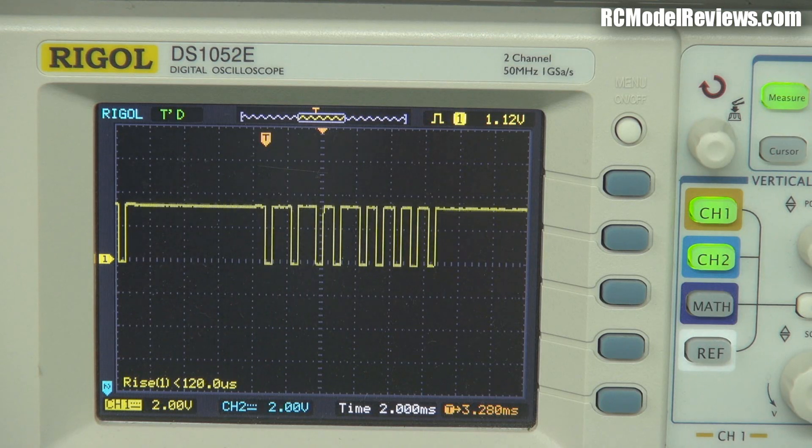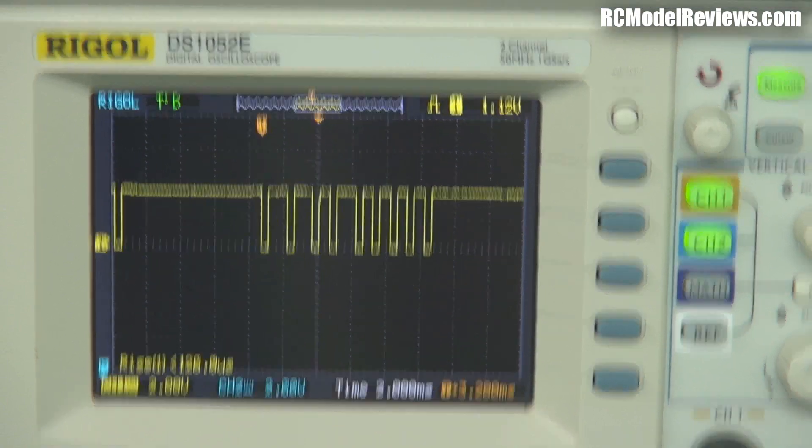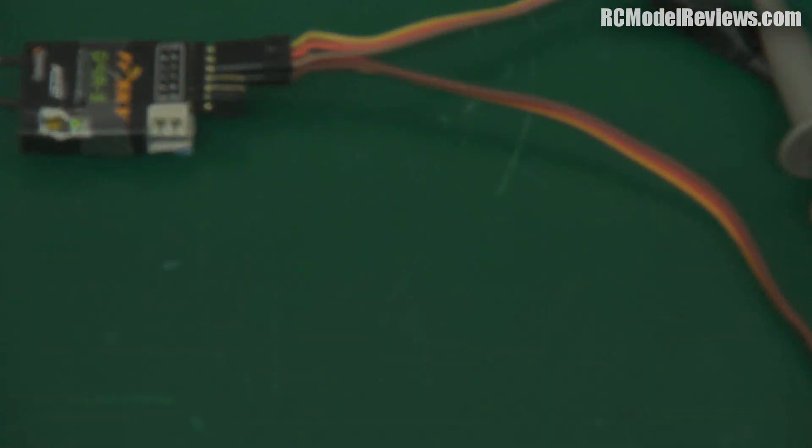If people want to see it, I'll show you how to reflash your D4R-2 and other FrSky receivers to use a longer frame for all the data, so it all fits in even when all channels are wound up to maximum pulse width. So there you go — that's one of the problems with CPPM, and that's what CPPM looks like when you throw it on an oscilloscope. If you've got any questions or comments let me know, I'll do my best to answer them.